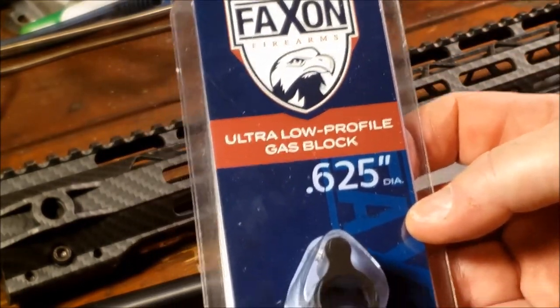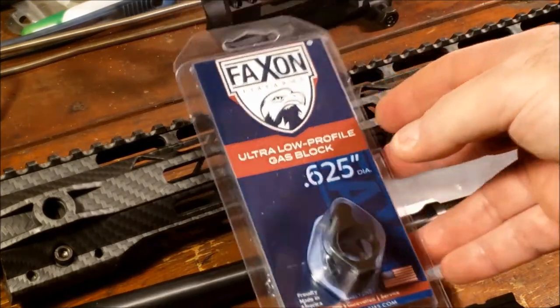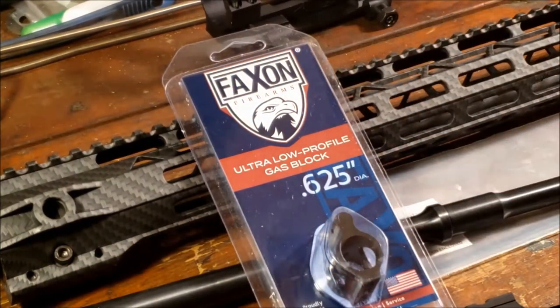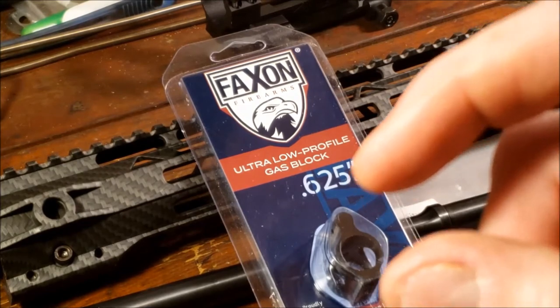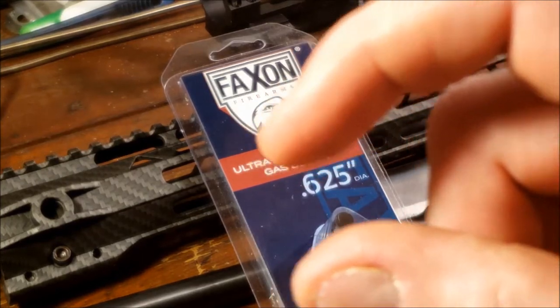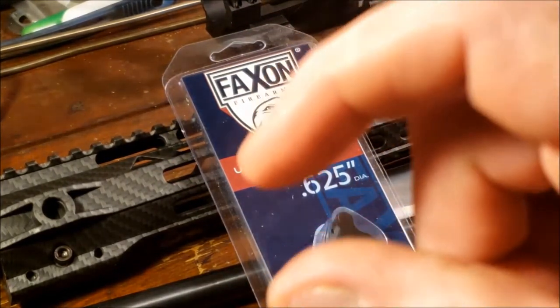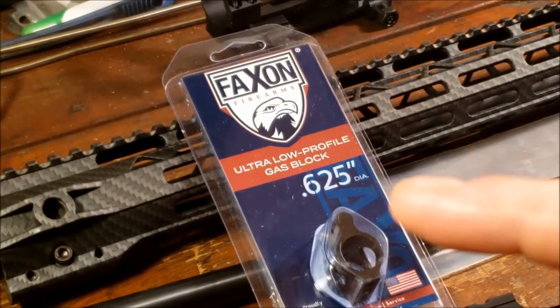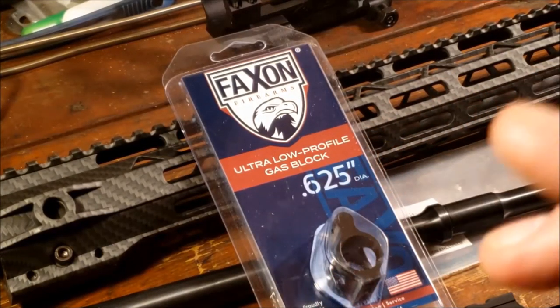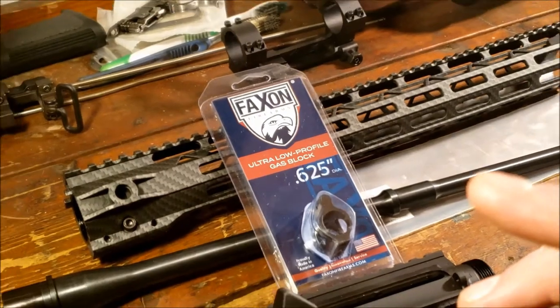So then you have that weapon by community organizer type of stuff where you look at the government profile M16A2 barrel and it basically comes out fairly chunky and then it steps way down underneath the handguard so it has some place for the M203 grenade launcher to grab onto. Then it comes up to the front sight base, then it gets fat again to 750, goes underneath the gas block and stays at that fat profile until it finally hits the flash hider. Why? Because that's the Marine Corps spec for that barrel. It made no sense whatsoever. Not that many people are going to be the grenade guys. That's just not how that one's going to work.